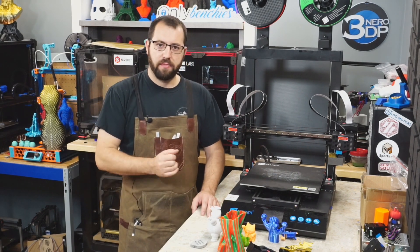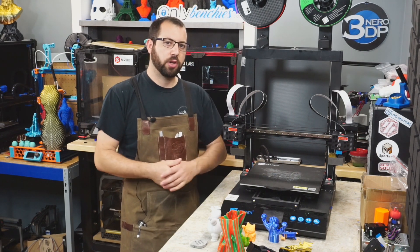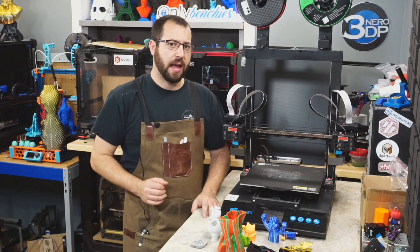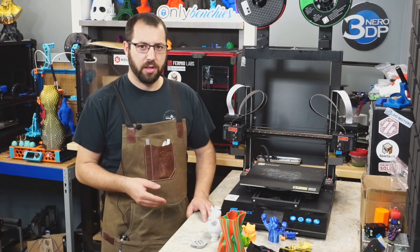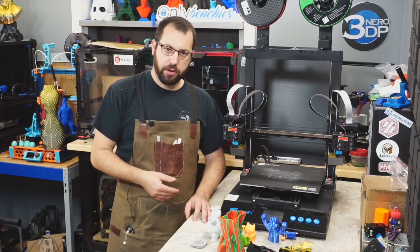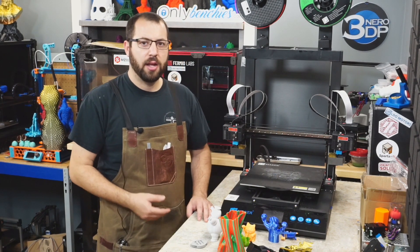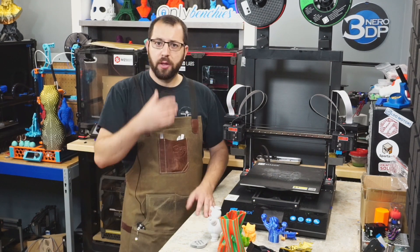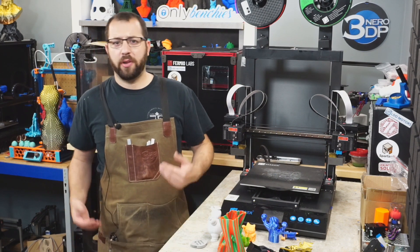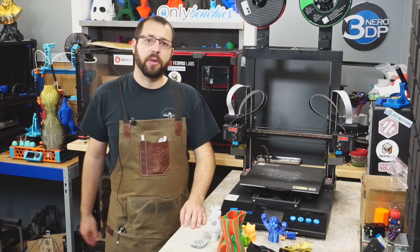In summary: it's a well-built, sturdy, solid machine with no mechanical issues and good overall performance. The biggest concerns are the proprietary nozzle heat-break assemblies — while the quick-change feature is nice, you're locked in — and the fans are quite loud, though the actual motion isn't too bad thanks to the TMC drivers. The biggest knock is the lack of a tuned slicer profile, especially for tool head changeovers between materials. I'd love to see a machine in this price range come with a pre-tuned slicer so you can take full advantage of it out of the gate. I hope you enjoyed this review of the JG Maker Artist D Pro — link is in the description. If you liked this video, hit that like button, subscribe for more content, and as always, have a nice day.